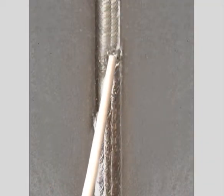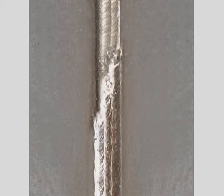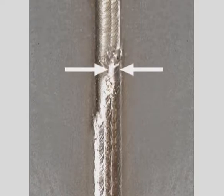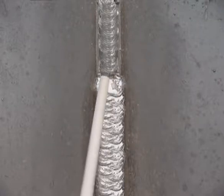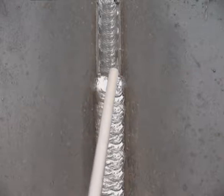On verticals, you can either use small beads side-by-side or run a weave bead. Small beads are easier — use the edge of the bevel to keep the first pass straight, run as many beads as it takes, but try to leave the other side of the bevel for a guide. If you're not limited to a maximum bead width, you can try a weave bead: start on one side, letting the puddle flow out to cover the edge of the bevel, cross the center relatively quick to the other side and hesitate until the puddle flows out and covers the edge. Move the rod up a little, then cross, hesitate, move up, and cross. The upward progress is going to be slow, heating the base metal up more, so turn the amperage down a little. Use the edge of the bevel as a guide to keep the sides of the weld straight, maintaining a uniform arc gap and keeping the upward progression tight. Weaving makes it possible to build up a lot of metal but takes some practice to consistently produce a uniform finished weld bead.